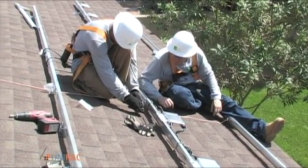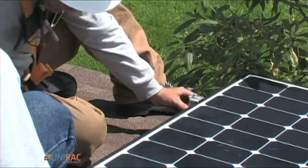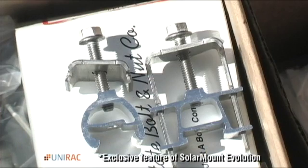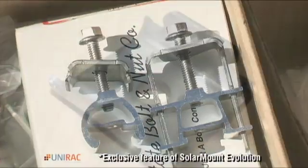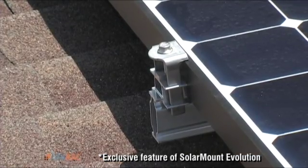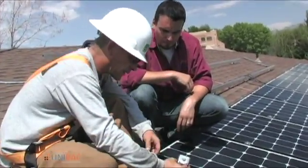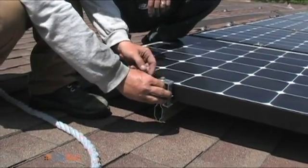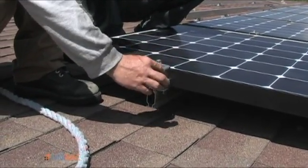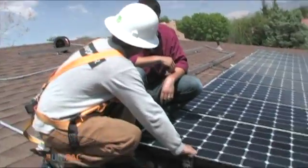Electrically bonding metal pieces of the array and earth is required by most AHJs or inspectors. The contractor will want to be well schooled in what the rules are in his area before using any special device. Good mounting structure manufacturers provide tested devices to bond module frames and beams. End clamps are used at the ends of each row. These slide onto the rail and once again have sharp teeth that dig in. They lock into the rail so you don't get any twisting action, giving a really firm grip. This part slides to the outside of the rail, making it adjustable to fit pretty much any panel on the railing system.